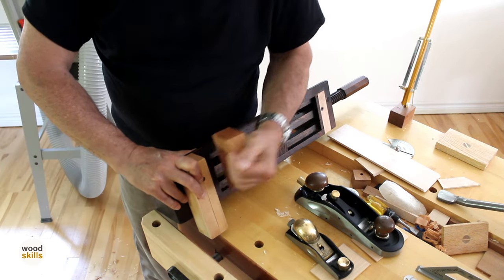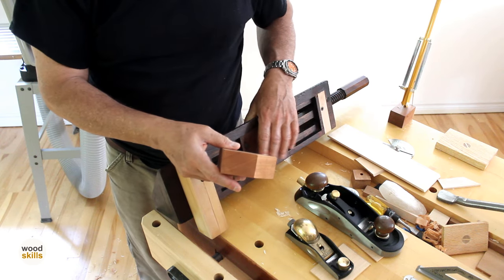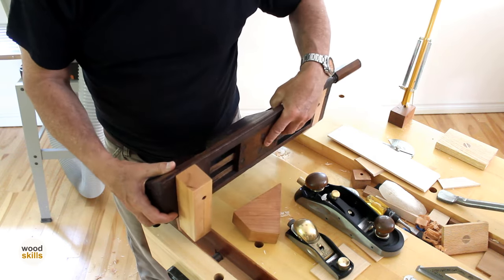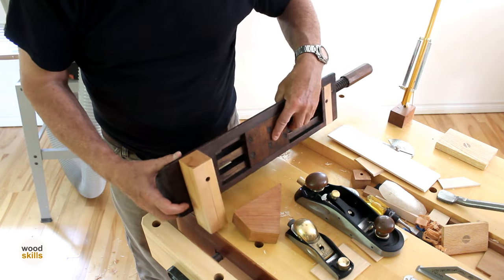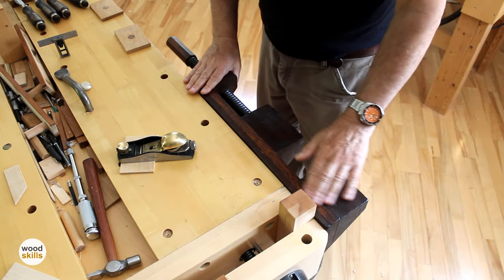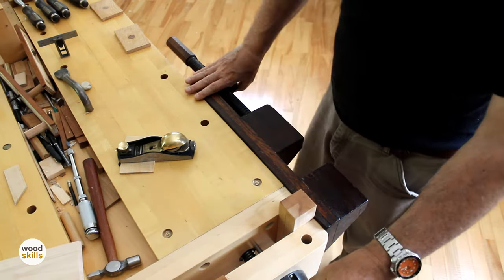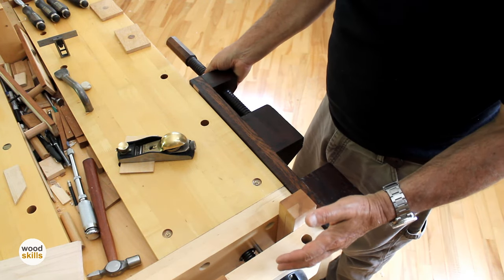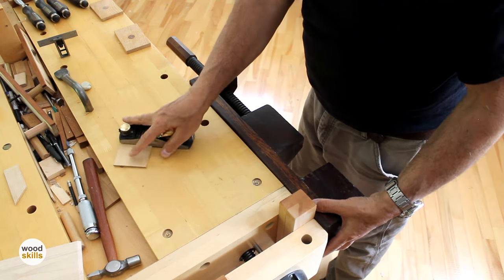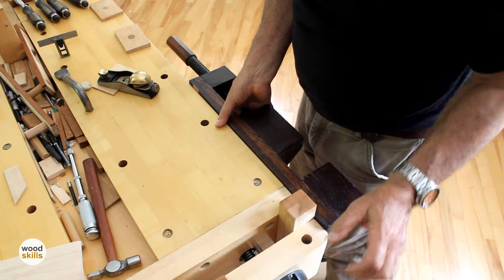And this is the mounting block again. It stabilizes at 45 degrees with its 45 faces oriented horizontally. Without that, I can just clamp it in the vise, and I'll actually be doing that at the other end, so I'll show that. So this is the same miter jack oriented with its 90 degree faces, and it's clamped into my twin screw end vise. Because it's a twin screw end vise and it's chain driven, I don't have any issues with racking, but I could easily use that same block. Actually, I will set it up with that block, because the block's width is identical to this width. I'll just release this.